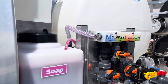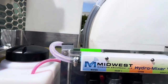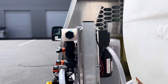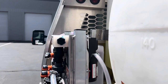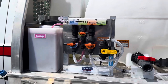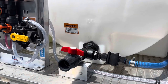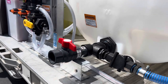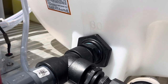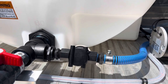We have our on/off switch and the pump is mounted to the back here, so it's all tucked away neatly. It's still serviceable but completely out of the way. We have our dump valve here — this is an inch and a half. This came out really nice the way we plumbed this. We got a T in there — that's a two-inch bulk head, downsized to one inch, and that feeds the machine.